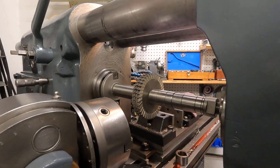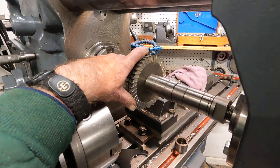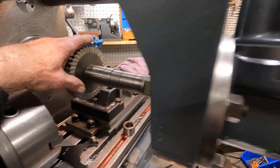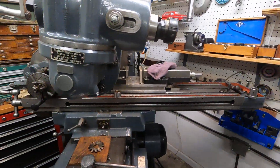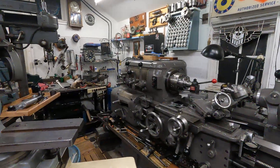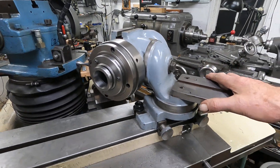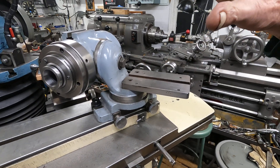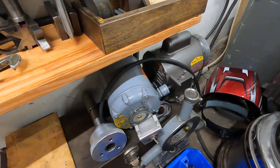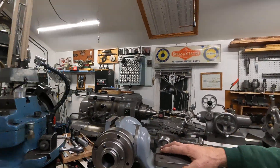I've got a horizontal mill here — I'll show you the size of the cutters. You need a good size cutter grinder, and that's what this is — it's for this type of machine and the other heavy machines I have here. Here's the standard work head. Generally, to motorize these, Cincinnati had a contraption for it, but I just stick that light gray motor on here — I think it's 1,125 RPM, one of the slower ones.